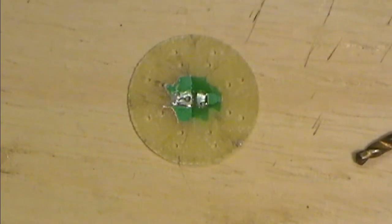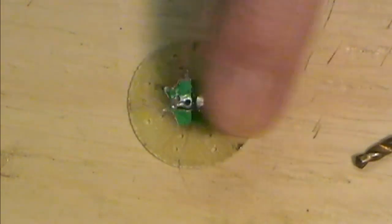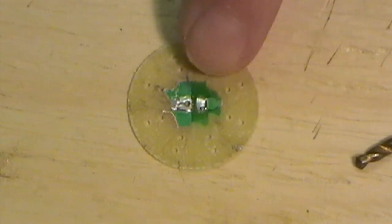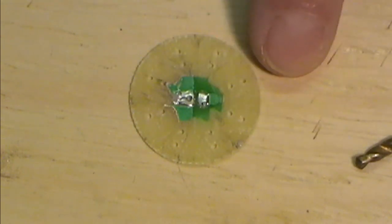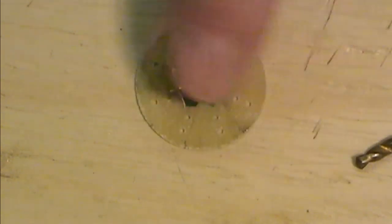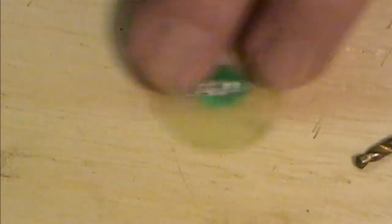Right, so very carefully with the Dremel, I've taken off all of the PCB that's printed on the top of there. I only want this middle pin, and that is going to ensure that I don't get any shorts between the casing and my center pin if the battery was to slip or something like that. Moving on, I'm going to go on to my switch.